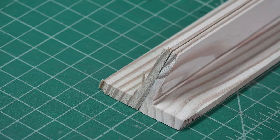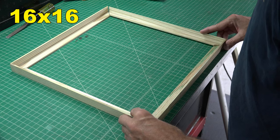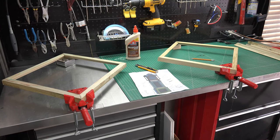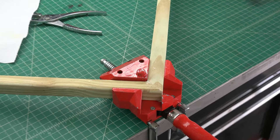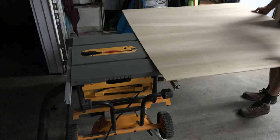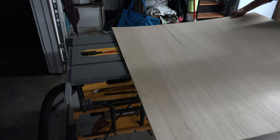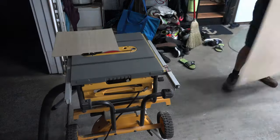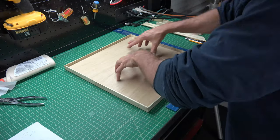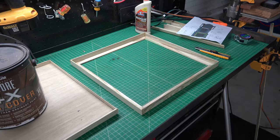For those interested in my exact measurements: my bottom box will be 16 inches high, 16 inches wide, and 8 inches deep — but I expect you to improve on my build. While my frames were drying I started cutting the birch panels to fill each box. Measure from inside edge to inside edge, top and bottom, draw it out on your birch, and make your cuts. We're simply going to glue each piece in — the glue around the perimeter of the frame gives it even more strength. For the face of the box, use quarter-inch medium density fiberboard for extra strength so we can hang doors.